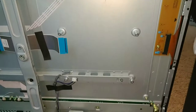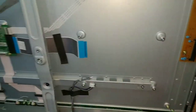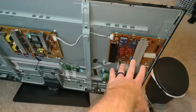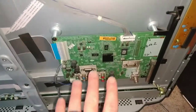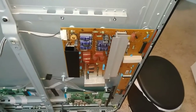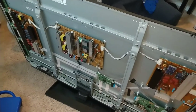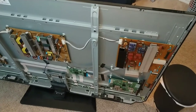Make sure you're cleaning the correct standoffs — these four here. I was cleaning on these two up here, but those are not it. Make sure you get the correct standoffs. I'm going to go through and tighten up every screw I can get my hands on, because the power supply ones were also a little loose. After going through and hand tightening all the screws, I found several that were loose on this board and this board over here as well. The worst of all was this one. I'm assuming the ones on here were due to it getting hot and cold — the screws working their way loose from the expansion and contraction from the changing of temperatures. Grounding is a must-have for logic circuits — that's why I kind of thought that might be the issue when I saw the flickering.